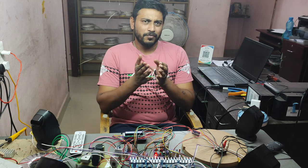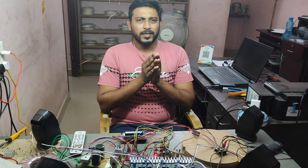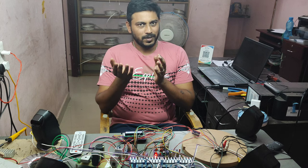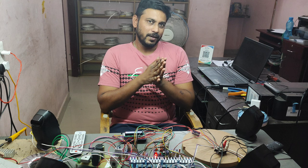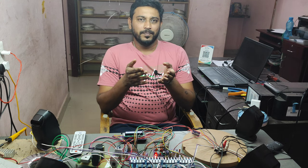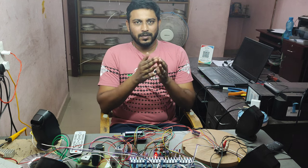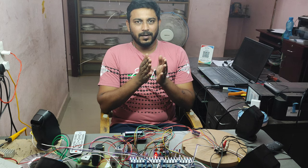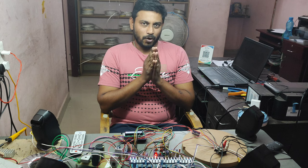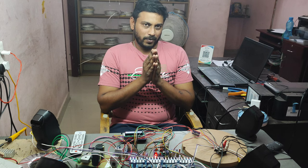Apart from that, the normal DTS kit I explained in the previous video, but a few customers are asking us to check each and every channel separately, which means the front channel separately, the surround channel separately, and the center and subwoofer separately. So in this video I'm going to check each channel separately, so that you can easily understand how the 5.1 is separated and how much it is filtered. As I said, if your audio quality is very good, you will get a proper 5.1 output.